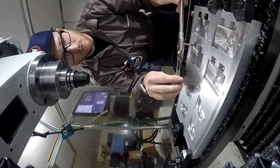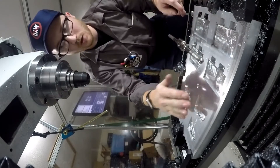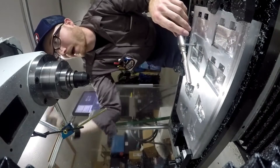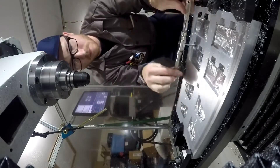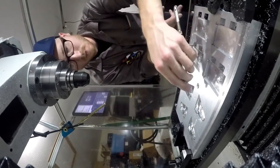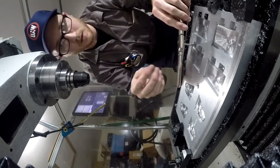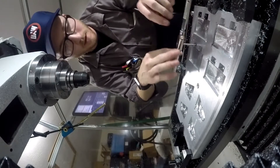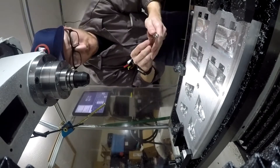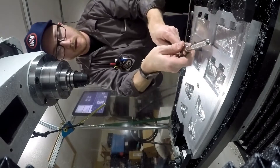The second was just a whole mess of stuff. I wanted to re-run the coolant lines halfway through because it was so low it was pulling on the fog buster. So I decided to cut the coolant lines and run them through the back instead of over the top, so I'd have more slack and they wouldn't be pulled as the spindle comes down. I split the side of the hose to get it off the barb easier, but I forgot to cut off the split part before putting it back on the line, and it was leaking everywhere.